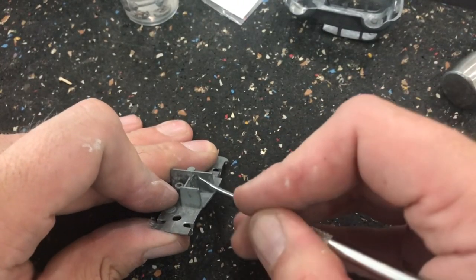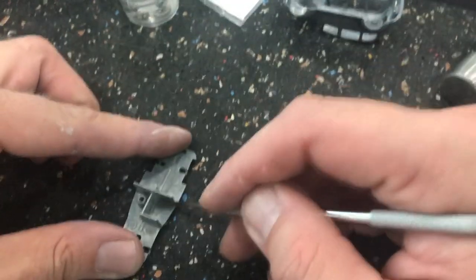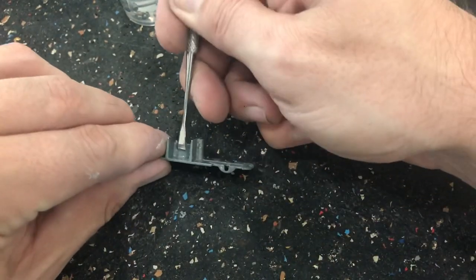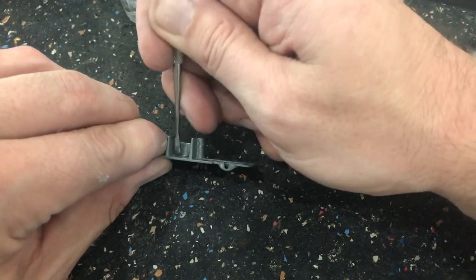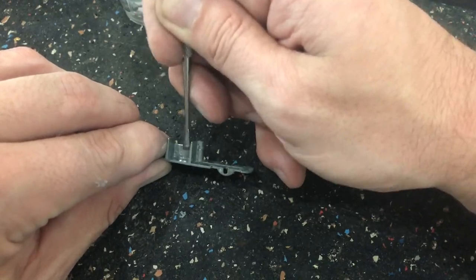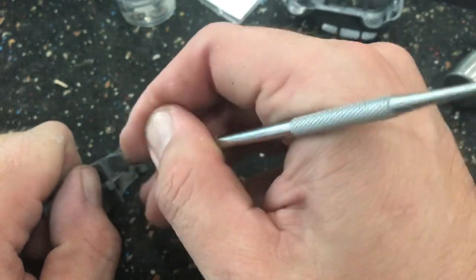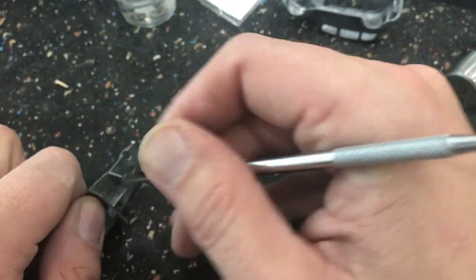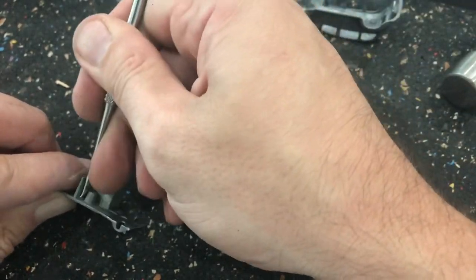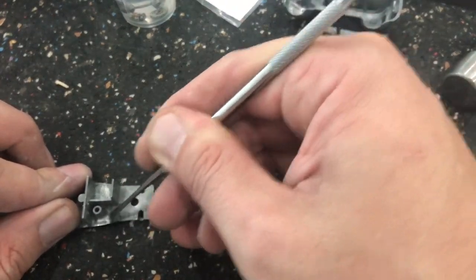On this base piece, you can see there's a fair amount of the original gray paint on there. Most of this is loose due to the citrus strip, so it comes right off. But I didn't have a really good way to get either my toothbrush or my little metal brush down into some of these crevices and cracks. So I'm using my little dental pick set — I really like this kind of flat-bladed scraper on here — very gently going over this and scratching loose some of that paint that's already gone through the strip process and just didn't quite let loose of the casting.